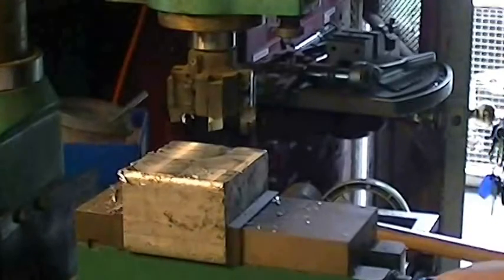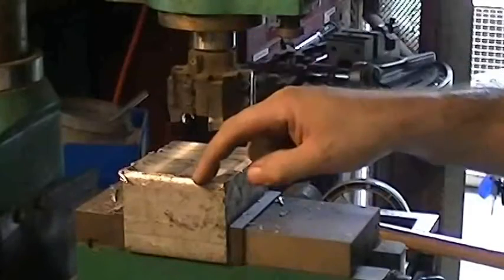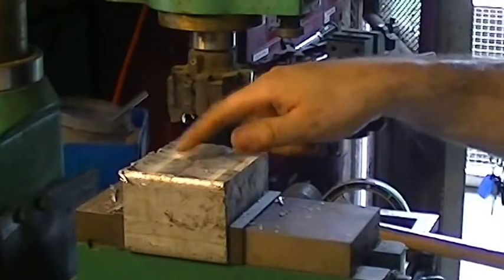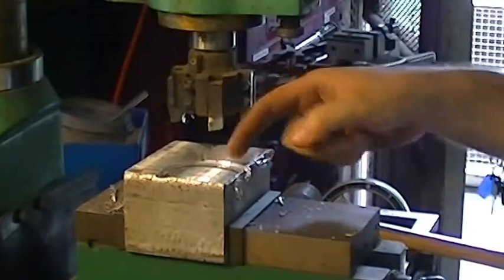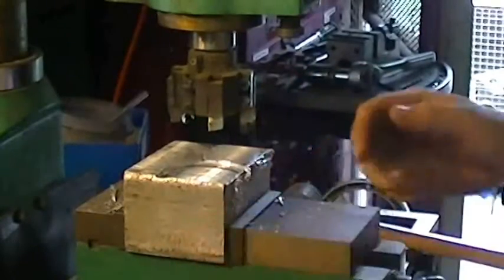Let me show you another noob mistake — and I do mean noob. Can you see the divots and the height changes in that? As I'm milling, this end of the stock is narrower in the vise than the other end. Since the jaws close evenly, I'm getting a good bite on one end but not the other. What was happening is the material was actually lifting up out of the vise on an angle as it was machining, going deeper and deeper into the material. So I'm going to switch the material around in the vise — instead of having it wanting to lift up, it'll be pushing down on the tight side. Once I'm done machining this side, I can flip it over and straighten the side so it'll sit in the vise nice and neat.